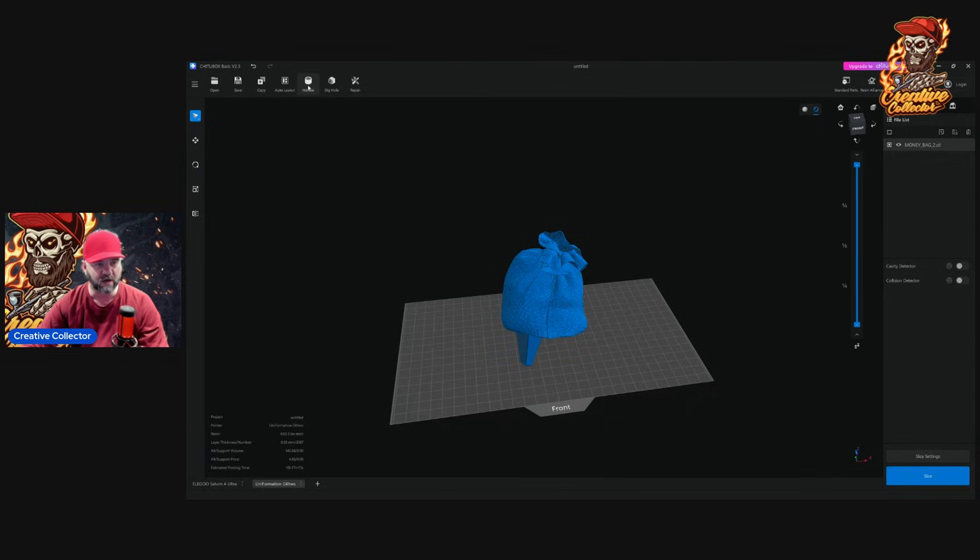The next thing I want to do is hollow it out. The wall thickness I'm going to set to my old setting of 1.8. Precision is by default at 0.2 — I'll leave that. Now the infill structure is different on this version: the old version had 'grid infill' but here it's 'cross 3D' or you can do none. The cross 3D gives me what I want from my old settings, with the infill density at five percent. So I'm going to go ahead and hollow this out now.